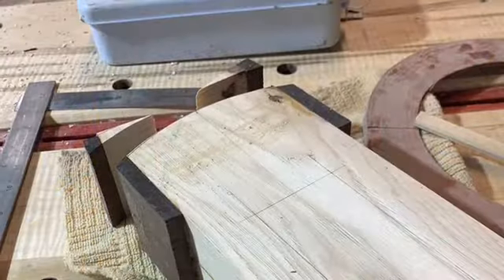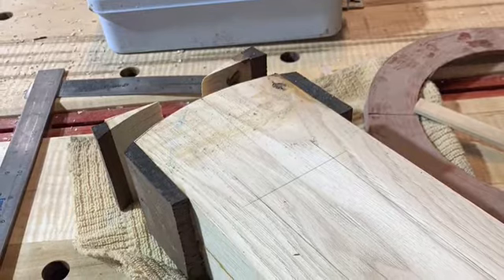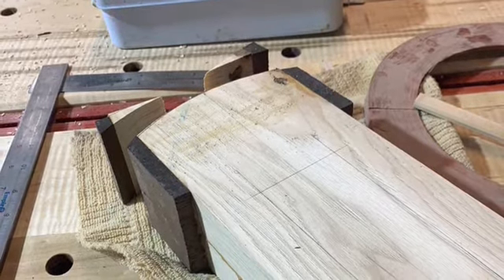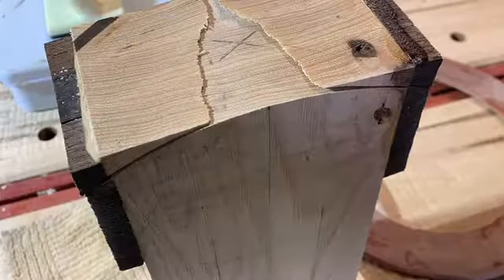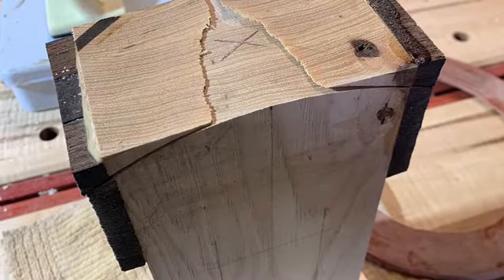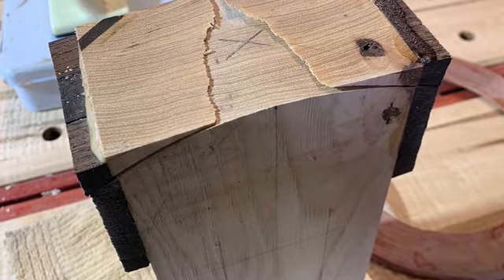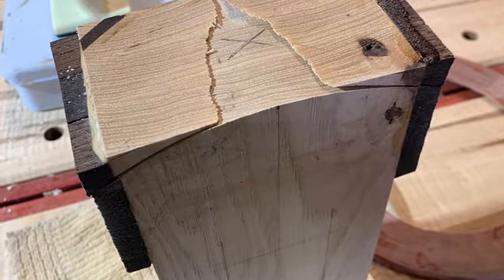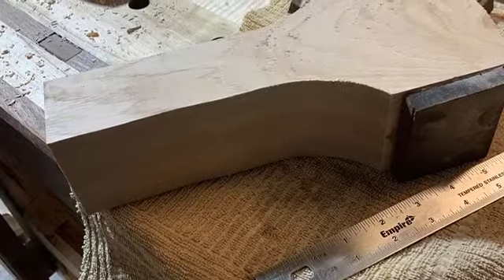What I do to make shaping easier is take anything in my shop with about a 12-inch diameter and mark an arc on the end of the block. Then simply cut it out on the bandsaw, save the pieces, and set them back in place to mark center — you'll see why in a minute. Because hickory is so hard and not an easy wood to turn, cutting out the basic shape of the handle first, leaving myself about two and a half inches, just saves me a ton of work on the lathe.